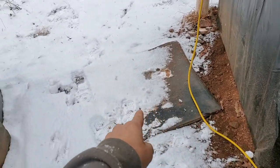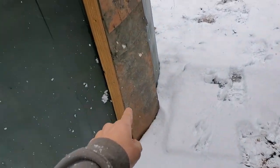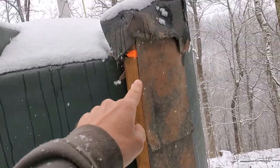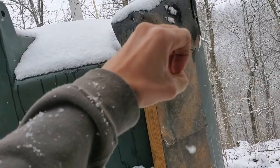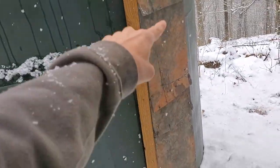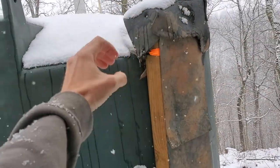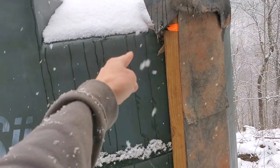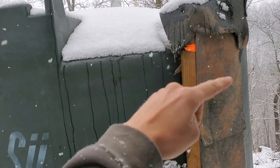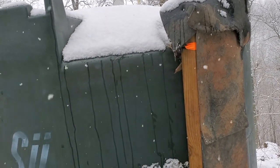The pickup from the pump runs underground, which isn't frozen up, and it goes up in this insulated section and then into the top of the tank. We have heat tape here so that keeps this warm, and the section of pipe that goes down into the tank actually stays thawed out just because the heat from the heat tape seems to cause the water to circulate in the pipe and keeps it from freezing.